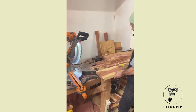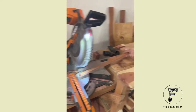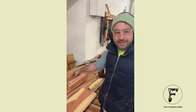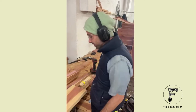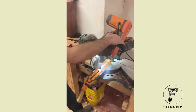What I've done here is set up a stop to the length of my longest part, and then I have a series of spacers that I made to help me achieve my other parts. That way I don't have to reset this stop — I can just keep all those spacers bundled with this whole packet. So what I'll first do is put my first cut in here on one side to clean up the first edge.